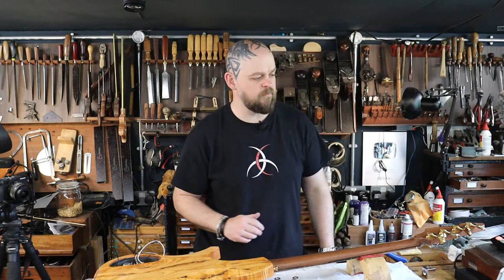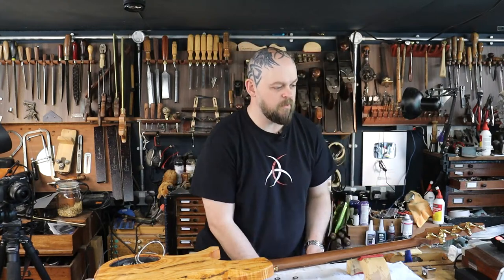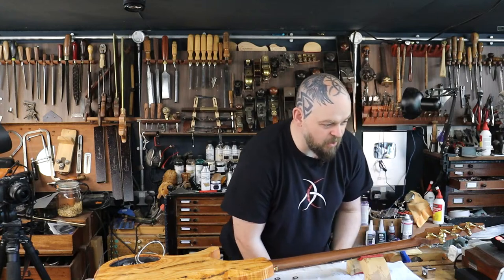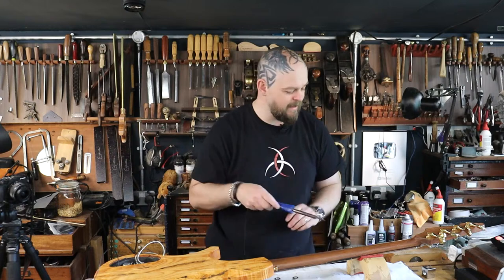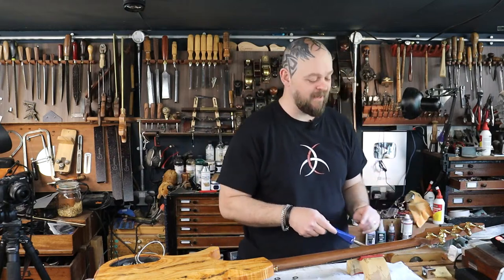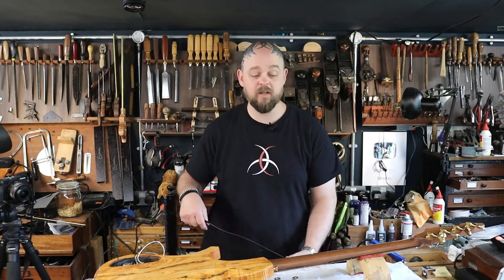First super chat of the day from StuNTV. It says, hi there, if installing a bridge on a holey piece of wood and one of the screws matches a hole, would you drill and dowel it or something else? Yeah, pretty much. Depending on the size of the hole, I might drill and dowel it. It's all going to be hidden underneath the bridge, so it's fair game.